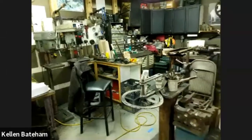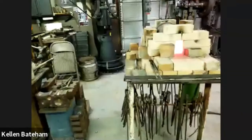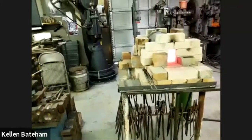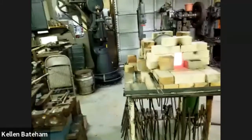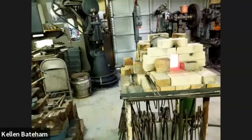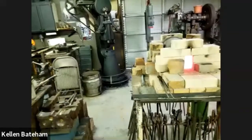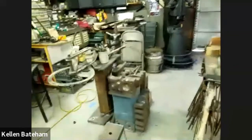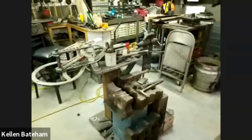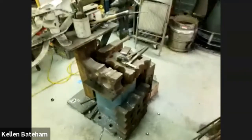Drill press area. Oh, it looks like somebody just asked how long does it take this thing to get up to 2,000 degrees? I can probably get that forge up to 2,000 degrees in 20 minutes or something. Doesn't take that long, but it's not quite as fast as just kaowool with a light refractory. Here I've got my bending vise station. They share a base, which is really solid, in my heavy steel block collection.